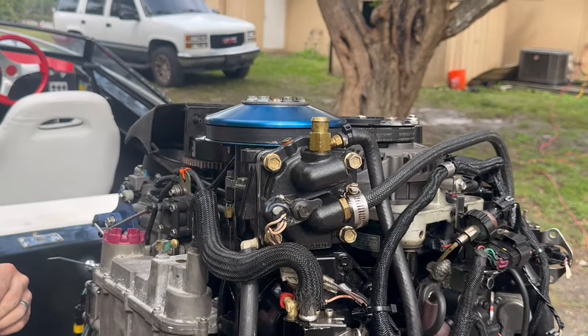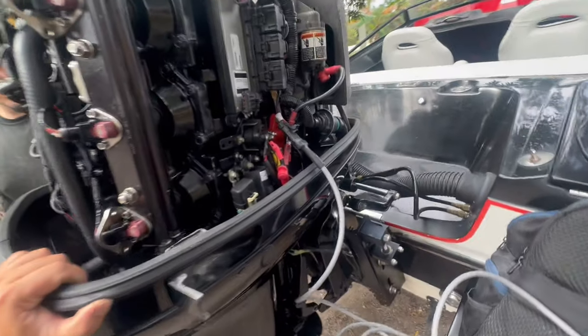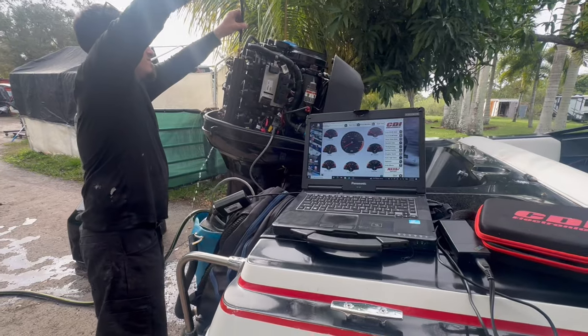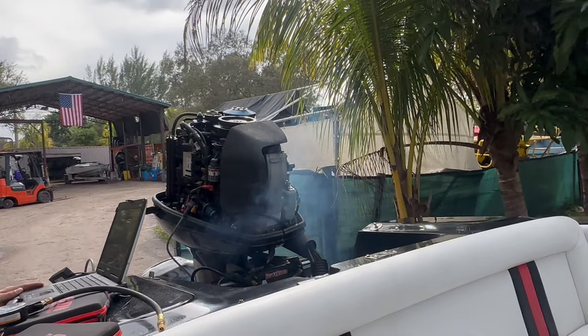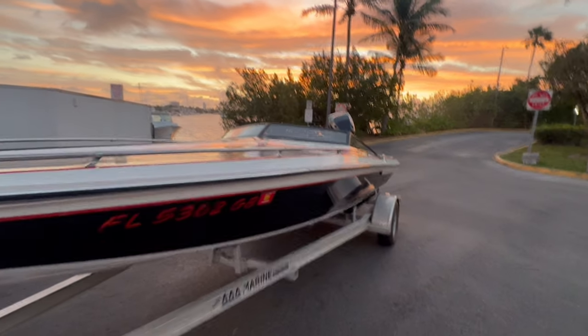I was worried I messed up the oil system with the first startup, but I guess we can now diagnose the misfire — hopefully it's one of these guys. After 36 hours of trying to fight a misfire, it was the most simple thing: I replaced everything on the motor and still had cylinders three and four down, and all it was were the connectors being swapped. We're going for our first sea trial — it's a beautiful morning. Stay tuned for the next video, guys — it's going to be the sea trial.